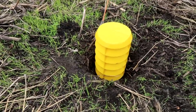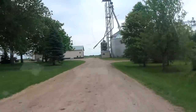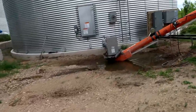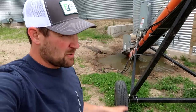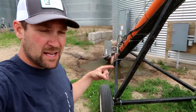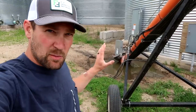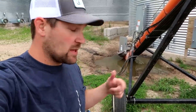Should maybe come shovel around this a little bit more. We've got to move some corn out of here later, so I'm going to have to pump that water out because we don't want the bearings of this conveyor running in that water. I'm going to have to pump that out and shoot some grease into those bearings to make sure they're cleaned out.